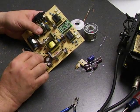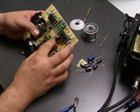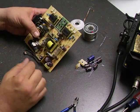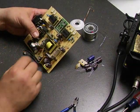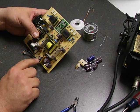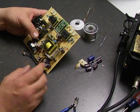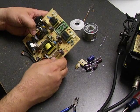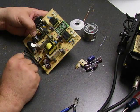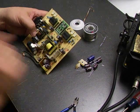If you don't use high ripple current and low ESR capacitors, you can further damage the power supply board. We have a kit available on our website for this particular unit. If you don't want to buy the kit, check our capacitors page — it shows the manufacturers with the proper series and values to get. You can't get these at a store like Radio Shack; you need to mail order them, as local stores only carry general-purpose capacitors, which are not right for switch-mode power supply boards.